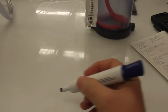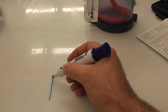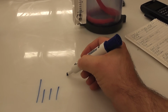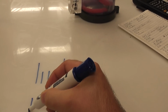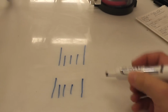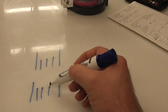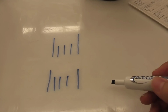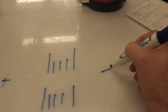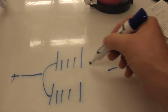So what do we have here? I'm going to draw these plates. Okay, so here's a polarity fixed plate, and these are neutrals. And I'm not going to draw all the plates, I'm just going to give you an example. Here's another cell, and polarity fixed plate, meaning they're connected to either negative or positive, but they're fixed, where these plates are not fixed. Okay, so what do we have? Let's say we have positive over here, we have negative over here. This is how people connect them.